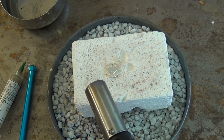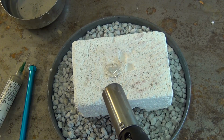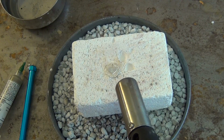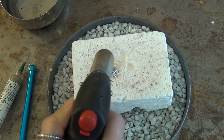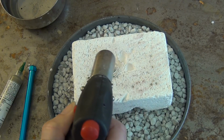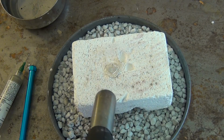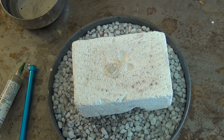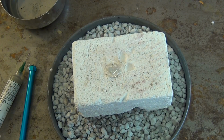And make sure that you watch a couple of our classes, especially Kate's beginner classes. She's a pro at this, has written 2 best-selling books, and she can really walk you through this in a great way. But we're going to come around. You're going to see a little bit of smoke, which is going to be the binder burning off. And then the flux is going to melt a little. And then you'll see, hopefully, a little flash of silver right around the edge. And that's when you know that it has soldered. Are you ready? We're ready. Are you excited? Yes. So excited!